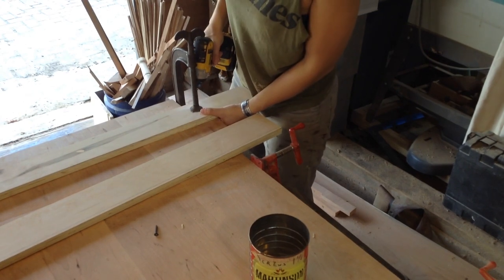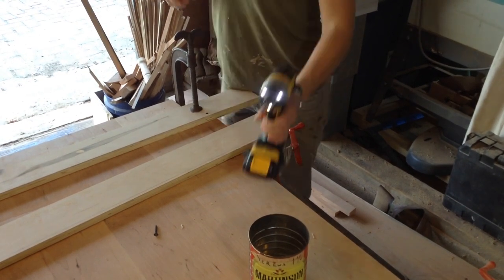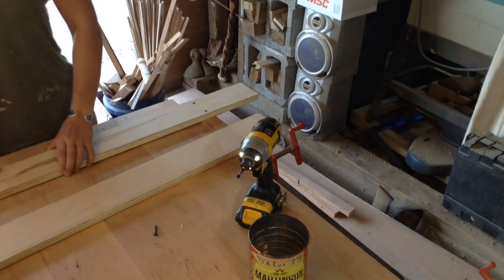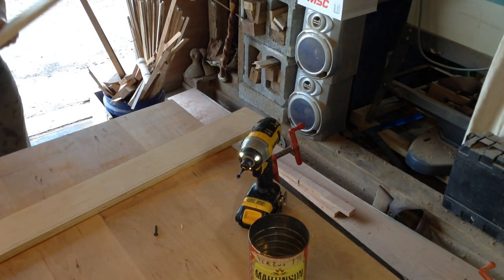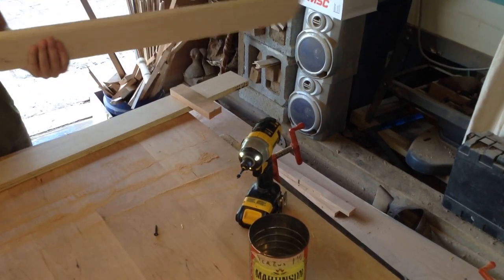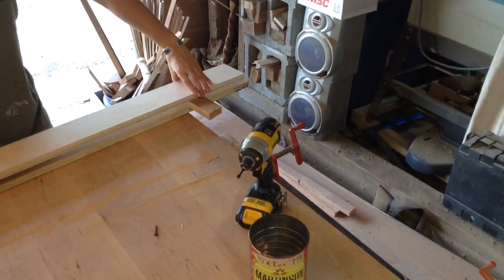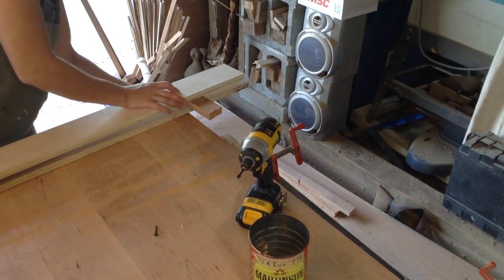So I saw this tip on Fine Woodworking. You basically take a scrap cut off from whatever top you're making, so it's the same thickness as your top, and then some straight scrap plywood, and you make this sandwich sort of jig so it fits on the edge of your table. It will give you two equal straight edges, one on the top and one on the bottom. So when you go to route out that tenon, it's the perfect distance setback on the top and the bottom.